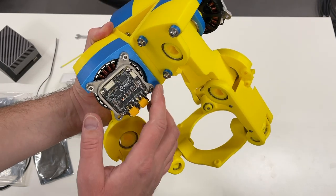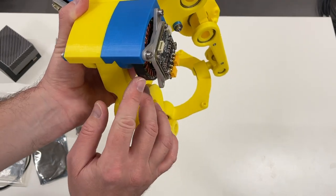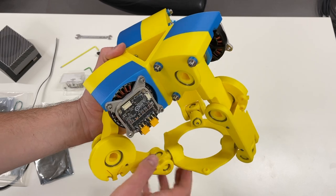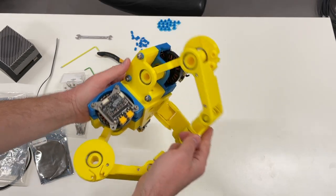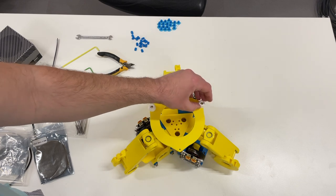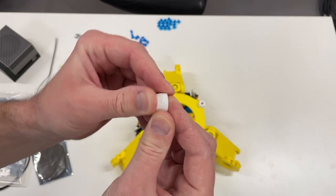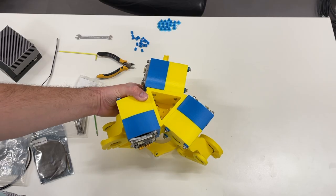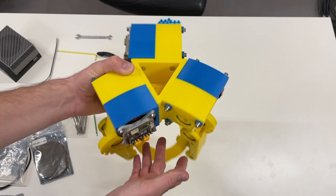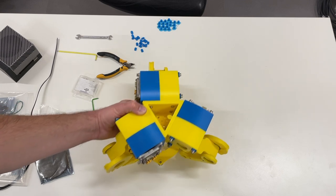I think I need to make a cover to protect the controller and also something to protect the motor, because most probably at some point it's going to fall. I have a small rubber foot which we can put over here, with screws and embedded nuts from the other side. They are not perfect because they are a little bit slippery, but it's okay for the prototype. I could make thinner or less-filled 3D printed parts to reduce weight, and probably decrease the number of screws.